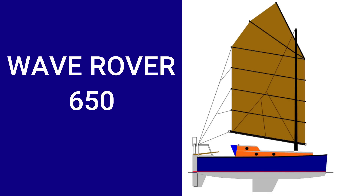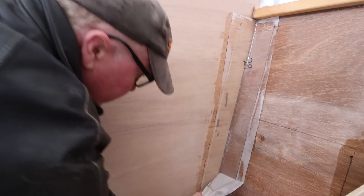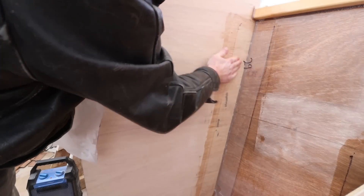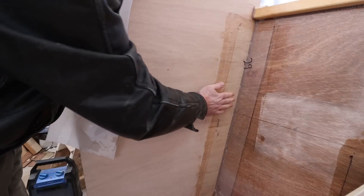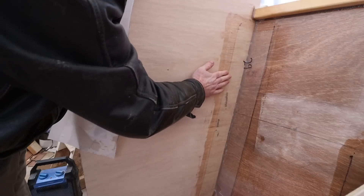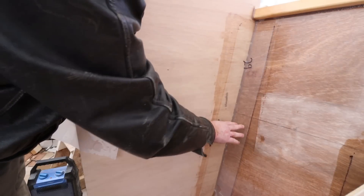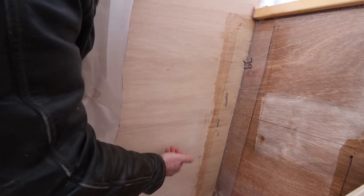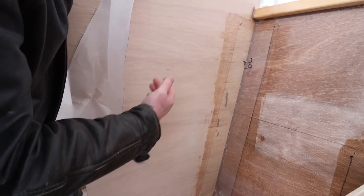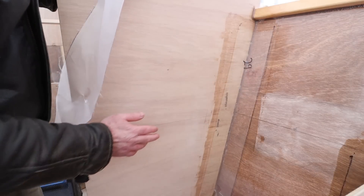The Wave Rover 650. Just a tiny bit of sanding required. The reason I put the peel ply on this area, and not the rest of the fiberglassing I did last week, was because this area will be above the counter — a paint grade area — so it'll make it easier to paint. The area below, you could use peel ply of course, but it's just extra work. It's about the amount of detail you want to put into your boat. I'm happy with this amount of detail and I'll carry on at that level.